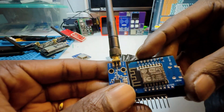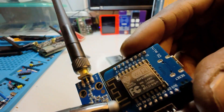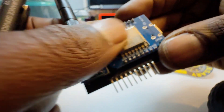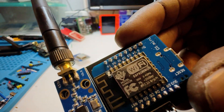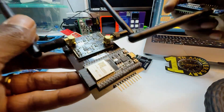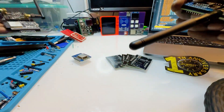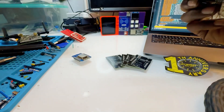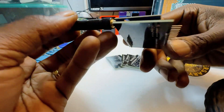This project can utilize quite a few different microcontrollers. For this one, I'm using the Wemos D1 Mini, which is an ESP8266. This module is really cool because it has Wi-Fi, although it does not have Bluetooth like the ESP32. But you can use an ESP32, or a Raspberry Pi Pico as well. So this project is pretty flexible with the microcontroller you want to use, but I prefer this one.